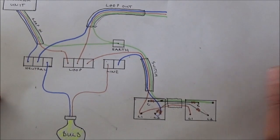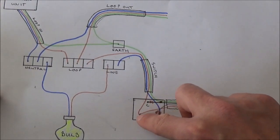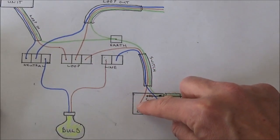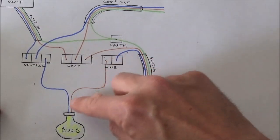On a one-way circuit this is where the brown wire would go into the common and then you'd use the blue wire as your switch live and place that into the L1. This way this would complete the circuit which when the light was switched on would return the current back up to the line through the blue wire, allowing power to go down to your light bulb. For more specific information on how to do one-way lighting, please watch my other video 'How to Wire a One-Way Light Switch - One-Way Lighting Explained.' There'll be a web link pop-up on the screen now and there'll be a web link in the description section below.